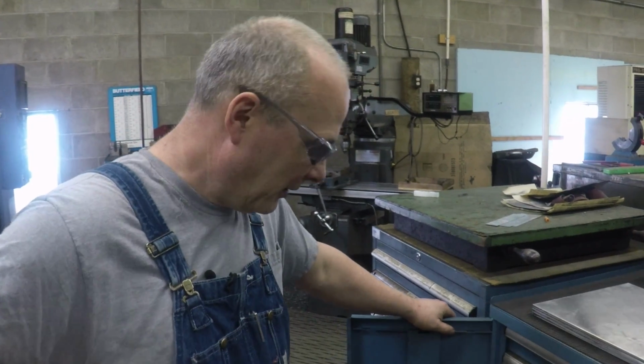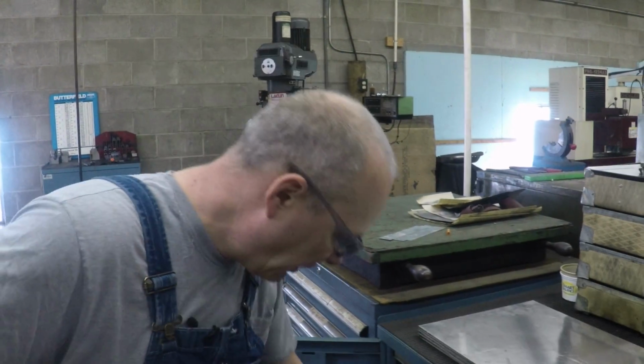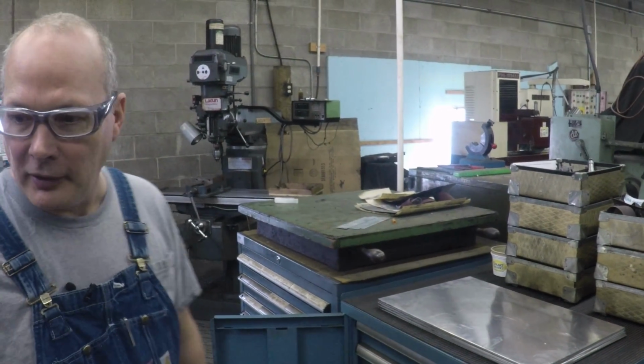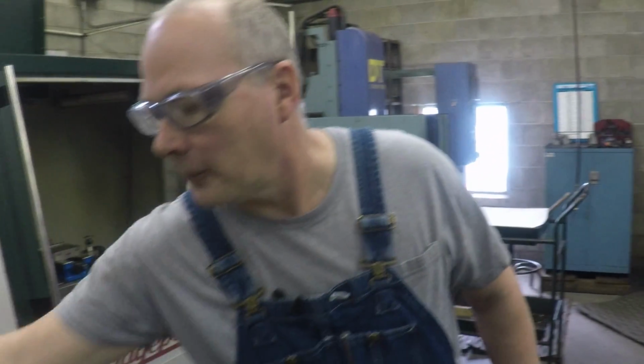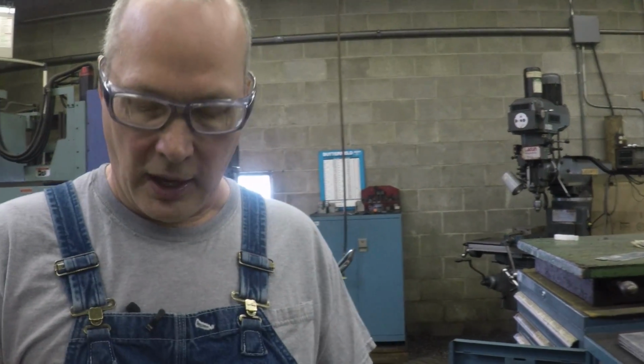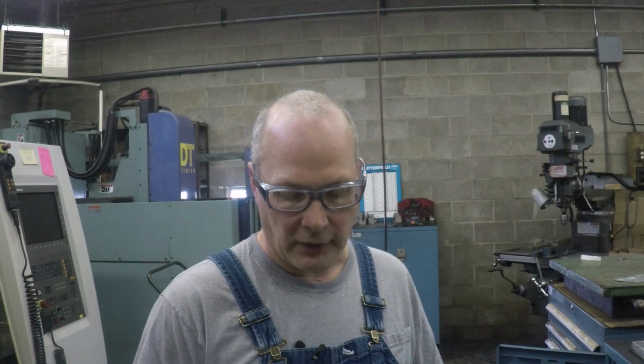I've got a few cutters here. I got a cutter from Sandvik that they want me to try. Oh, this is one of the 390s? Yeah, those high feed mills. I was looking at their screw-on type, the modular, where it has a tapered Acme thread on it and screws in the end of the holder. I've got a ball milling system, and I was asking about this cutter.